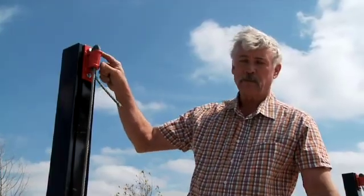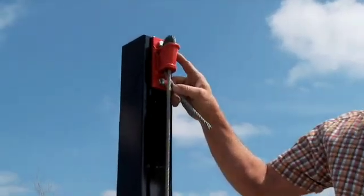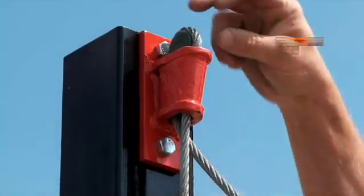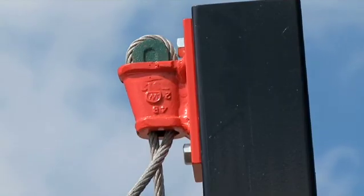The system that makes this truly unique too is how we mount to the docks. This bracket was custom built for our docks. It involves no cable clamps. It's infinitely adjustable. You simply bring the cable through up, loop back through, put this green wedge in, and as the tension's applied, it tightens automatically. No cables, nothing more to fuss with. Extremely easy.